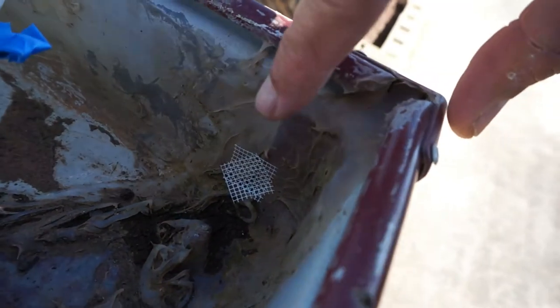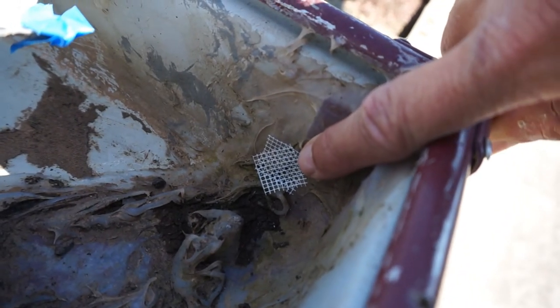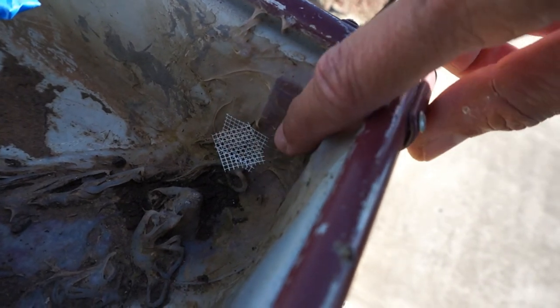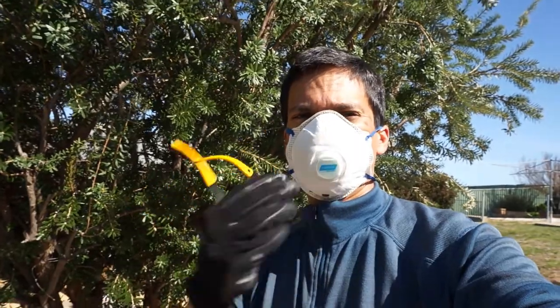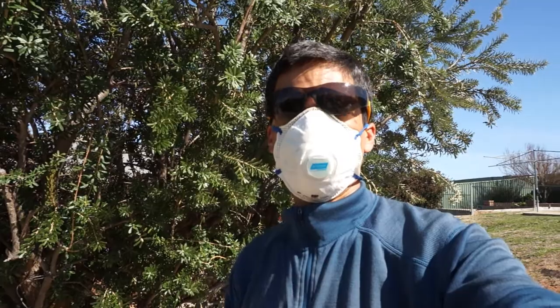I've got the roof mask there to stop overspray. The can comes with a little bit of adhesive netting — so if there's a bit of a gap or a crack, put two pieces at 45 degrees so they're crisscross onto that patch before you spray. Don't forget your safety gear: mask, glasses and gloves, because the spray is quite corrosive.